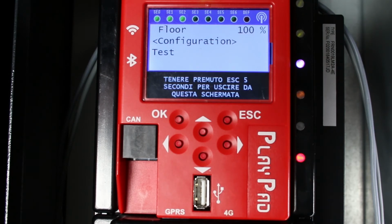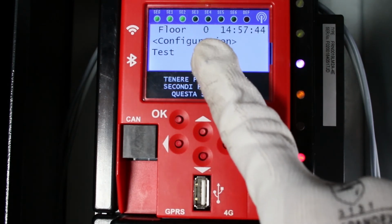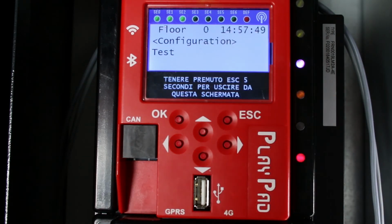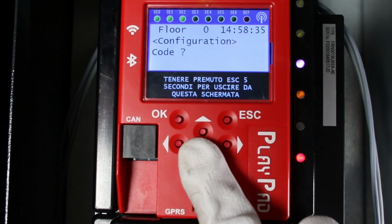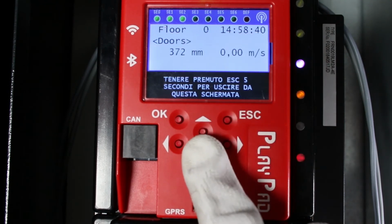Before switching the elevator to normal operation, it is necessary to perform the automatic learning procedure. In this case, the correct upper and lower levels of the stops will be set for each floor. Therefore, we stop the elevator on the lower floor, load the cabin with a load equal to half the load capacity, go to the counting menu and look for the auto setting item.